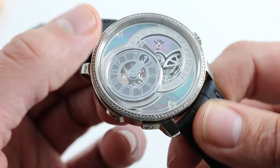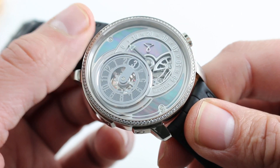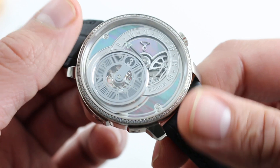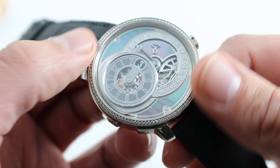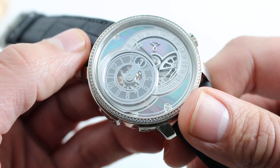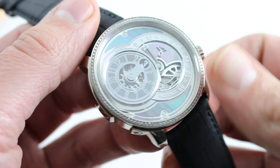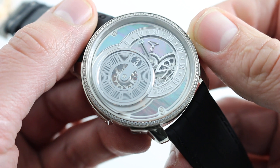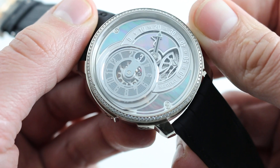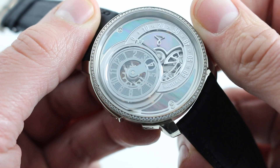It's a nice complement to the mother of pearl on the dial itself, which does really shift its color and brilliance in different lights at different angles. Now, the complication — even amidst the mother of pearl, the gold, and the diamonds — remains the star. It is a jump hour and it is a retrograde. And you can see in the partly skeletonized dial the rocker arm that actually controls the retrograde system and simultaneously reverts the retrograde and jumps the hour.